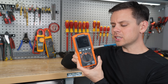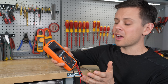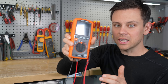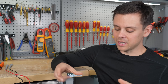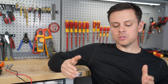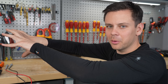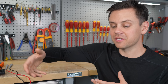If you don't have a multimeter but really want to work on something, wait until you have one — that's a rule I've always had. I am very scared of electricity; I was shocked pretty bad as a kid. If I don't have a multimeter, I will not touch anything, no matter how many times I've turned everything off. Next, low voltage things might not have a shock hazard but they can generate a lot of heat and burn you — bad connections on a battery terminal or inverter can get extremely hot. Even if something is completely turned off, still use one hand. I use one hand even when tightening battery terminals. I've just gotten used to doing that.